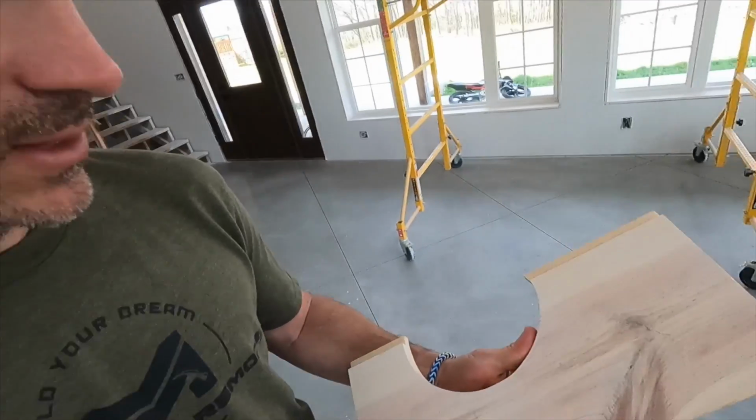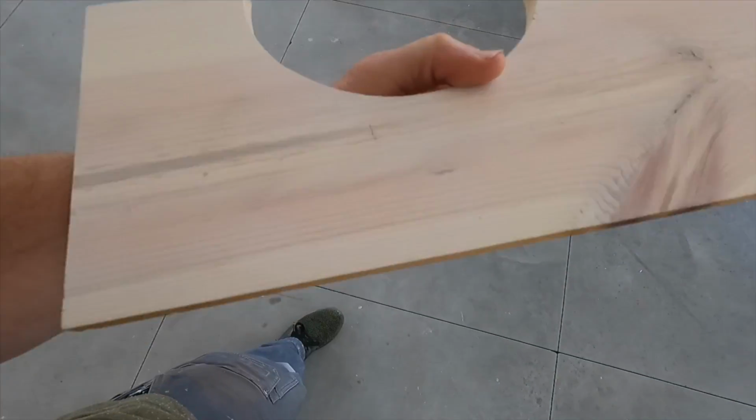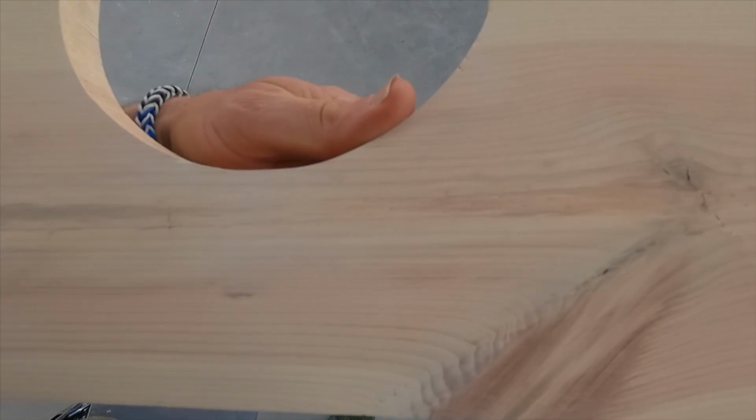So what we are going to do is a 50% paint, 50% water mixture. And it's almost like a stain. We're going to apply it with staining pads, and we will be able to keep all of the natural look, but it'll give it just a tint of white, and thus keep it from yellowing. So this is what it'll actually look like. We did a couple test pieces. It's hard to even tell, but we are going to get after that right now.